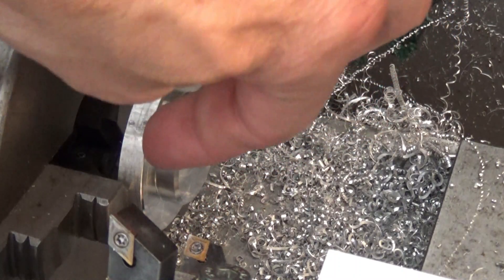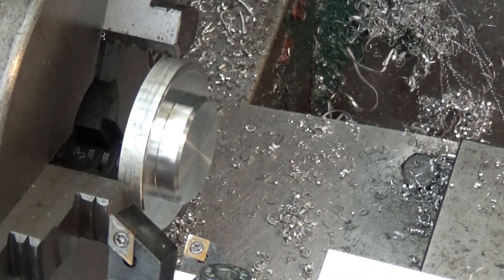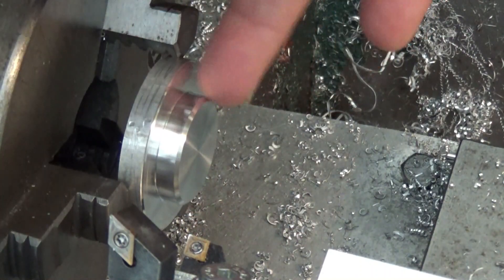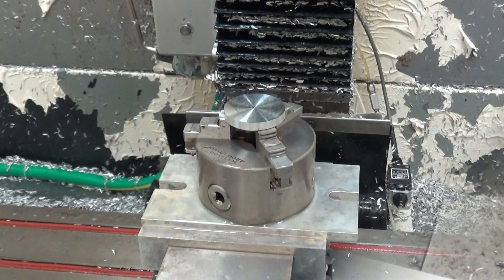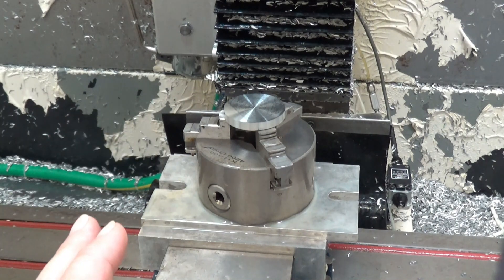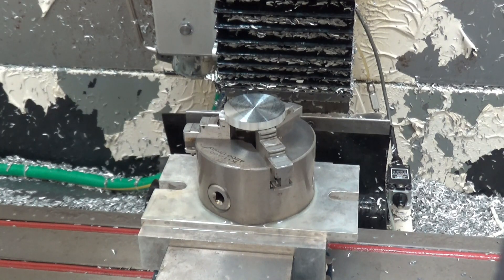Pretty good — this was without coolant of course so I could film it, so it is kind of warm. That's one operation. Then we're going to clamp it on this piece, on this portion here, and I'm just going to get the OD dimension and then we'll take it over to the mill and finish it up. We got the part set up in a three-jaw chuck and we're going to be doing three operations: some drilling, some adaptive, some cylindrical boring, and then some contouring — so four operations.